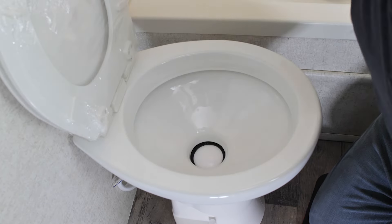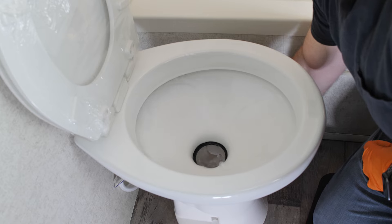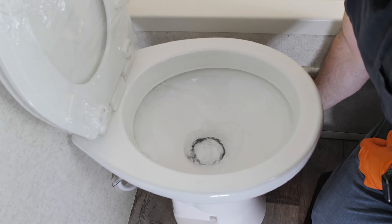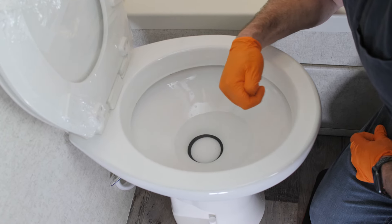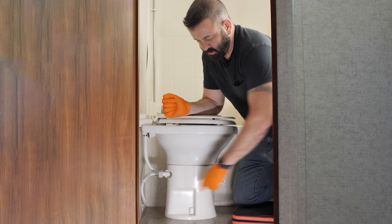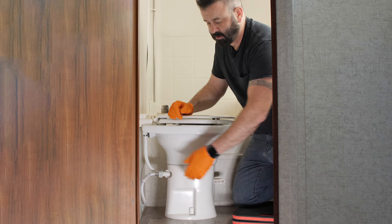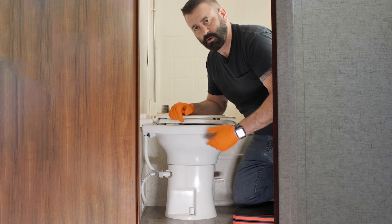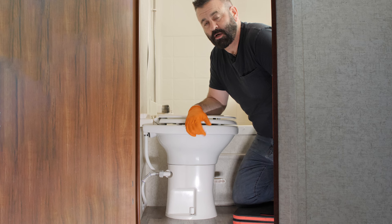Now we're going to flush it and make sure that it works. You're going to want to leave at least an inch of water in your toilet at all times — that makes sure that the toilet seal doesn't dry out. So that's it — you've got your brand new premium ceramic toilet installed. One thing that might be a good idea is to run a bead of waterproof silicone caulk around the base of the toilet so that if there are any leaks, it doesn't get underneath the toilet and into the wood of the floor. It's pretty easy to install Camco's premium ceramic toilet. I hope this video was helpful — please leave any questions or comments below, and thank you for watching Camco.